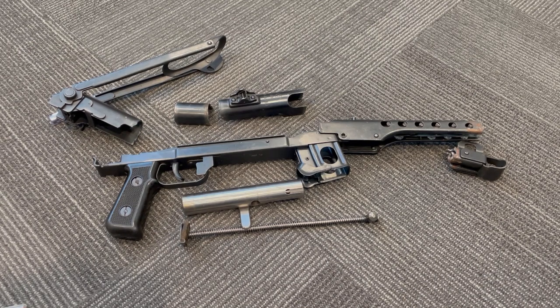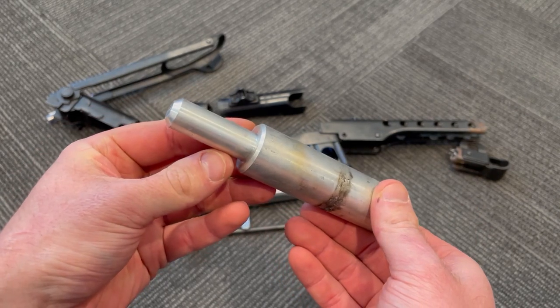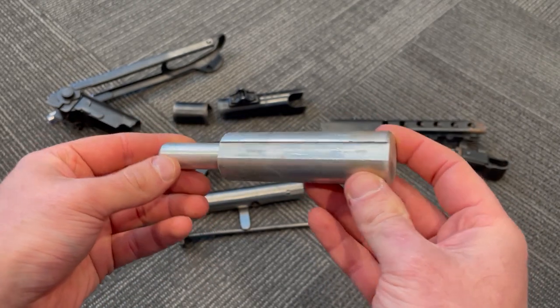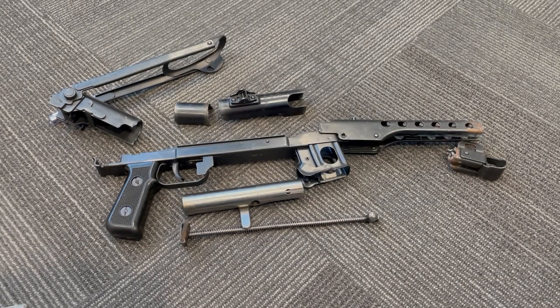The top is cut in a few different places, with really minimal slag on the welds, making it easy to re-weld back together. You can use a 1⅛-inch aluminum or copper rod as the backer plate for welding. But there's also a re-weld jig that will help align your trunnion with the rest of the receiver a lot better than just the rod. You can get these on eBay fairly cheap. It has a recess cut for your blocking bar — your denial bar. It turns out a lot better and you don't have a lot of grinding on the inside to do. We do suggest getting one of these re-weld jigs.